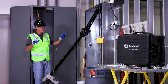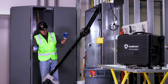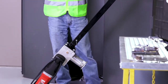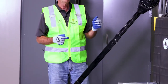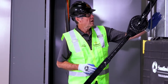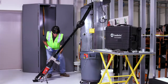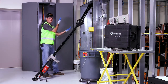Now there are two key elements in this pull right here. Number one is my capstan is pointed down. To date we've really not shown you any pictures where your capstan is pointed down for an overhead wire pull. The reason I want it pointed down is I want to take my rope and my wire from my conduit, make sure it touches this roller, and goes back to my capstan. Everything is on the downside of this puller.